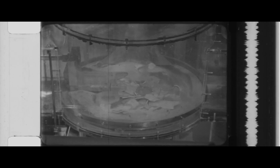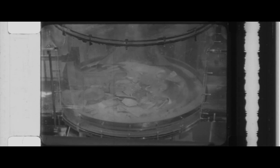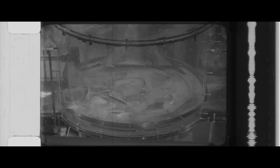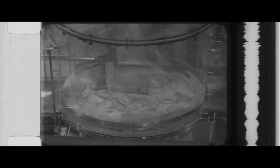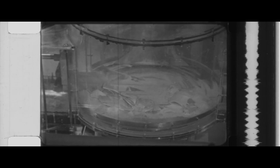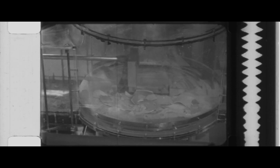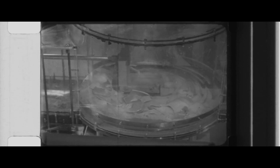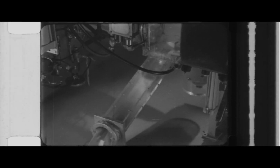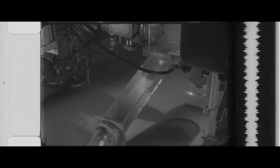The crucible fragments, magnesia sand and slag are separated from the plutonium button. The turntable and brush are remotely manipulated to free the button from loosely adhering residue material. The residues are stored in a container for eventual removal. This is the plutonium button as it is pushed down a second chute into a plastic bag for transfer to fabrication facilities.